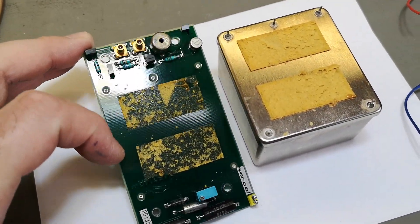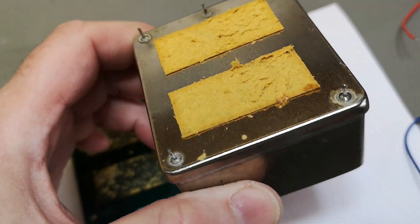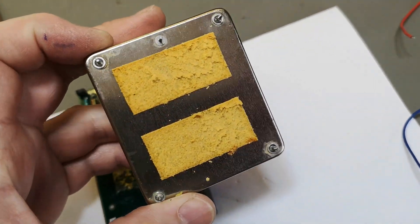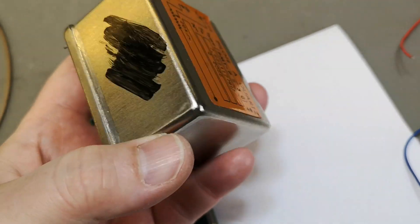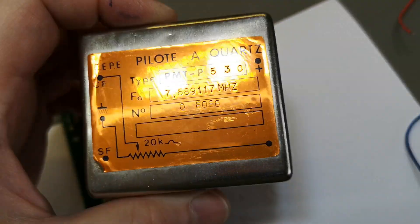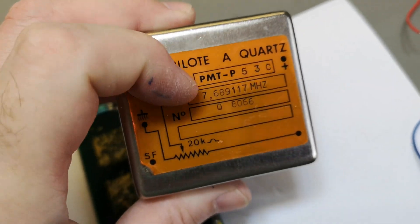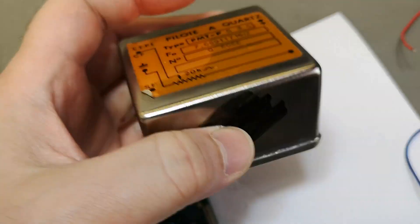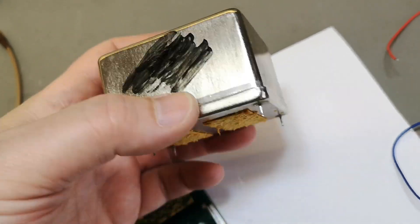This is how it was mounted — with double-sided sticky foam. It is really, really well made with three feet for mounting. The only way to get in is to destroy it, and I can't use this unusual frequency for anything. I could maybe replace the crystal with a 10 MHz crystal and reuse the casing and regulation circuitry, but I've got a whole case of these coming in, so no worries.